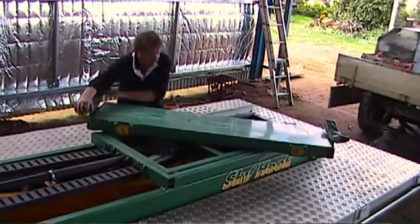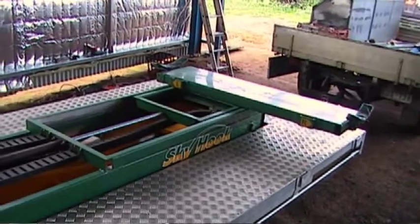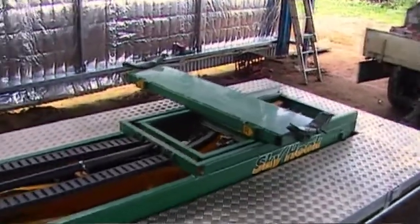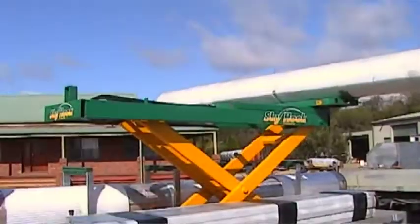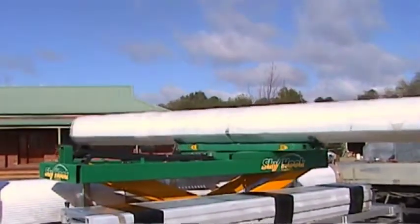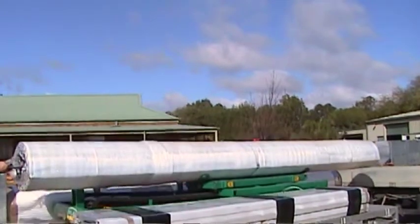The cradle can rotate 160 degrees through left and right of the starting position, which allows for precise positioning of the door into the working space. The Skyhook door positioning system sits atop the Skyhook lifter and carries the in-out trolley which has 800mm of travel in and out. The cross slide is mounted on the in-out trolley and also has 600mm of travel left and right once rotated. These three directions of movement, combined with the accurate height control provided by the Skyhook lifter, enable easy and accurate alignment of the door with the opening.